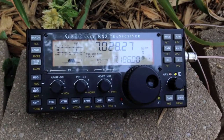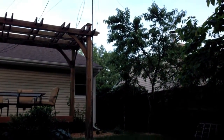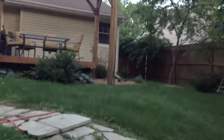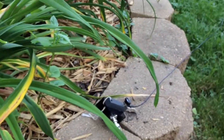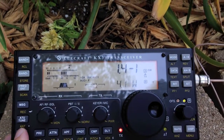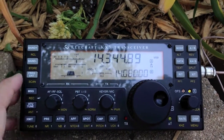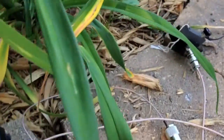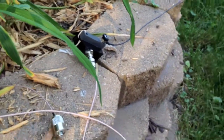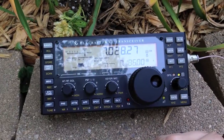I moved down to the bottom of the yard. Now I have the antenna strung up on the squid pole so the 40 meter end is on the top of the pole, coming down close to the ground — that gives it a really narrow response on 40. With the PAR, down in the CW section it's way good; it's not so good in the voice part. On 20, it's a little high on both ends, which is due to the wire being about a foot off the ground.